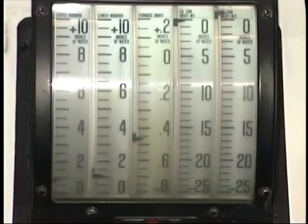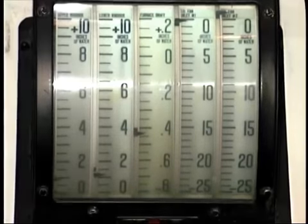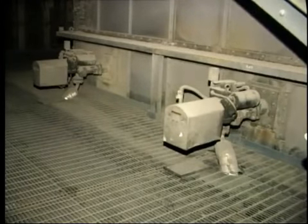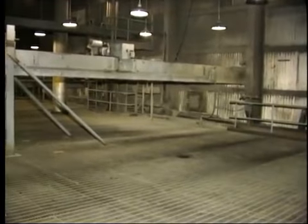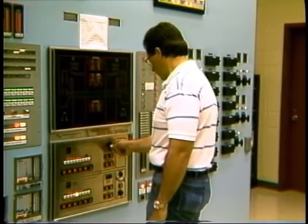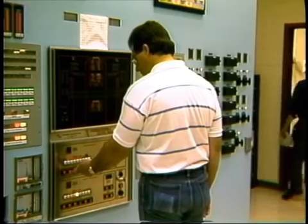But a greater problem is that the higher gas temperature may be sufficient to bring certain elements of the ash into a molten state, forming large clumps of slag that can block the flow of gas through the superheater and reheater tube banks. Apart from visual inspection, this condition can be confirmed by looking at the draft pressure indications at different points in the boiler. In order to help maintain clean furnace walls, a large number of rotary soot blowers are installed on the walls, in addition to the retractable blowers that are provided to keep the superheater and reheater tubes clean. In many plants, it may be necessary to operate all or at least some of the soot blowers on every shift. This operation is usually performed remotely from a panel in the control room.